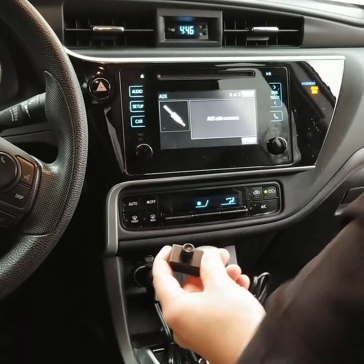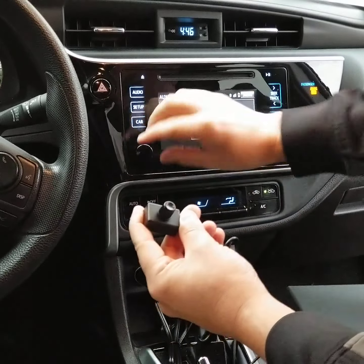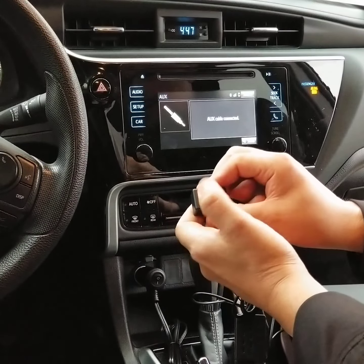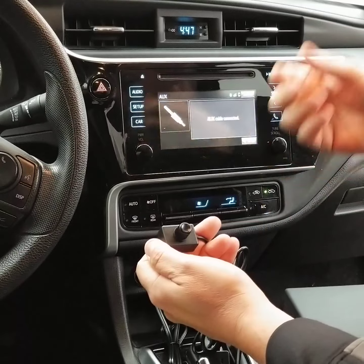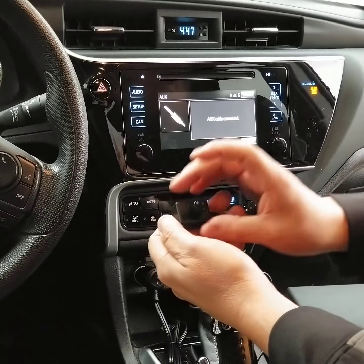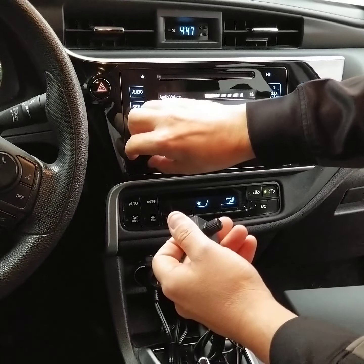The unit comes with user instructions for the CD controller, which explain how to operate it. This is a multi-functional controller that gives you the ability to change songs, go back in songs, go backwards, pause the music, and play the music. You can also increase or decrease the amount of sound from the unit by holding it to the right or left. Note that this is not a volume control — it's a gain control. It controls the amount of signal sent to the radio so the radio has viable sound to control.